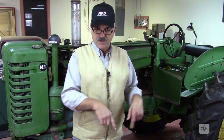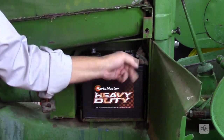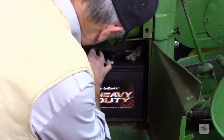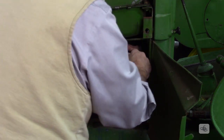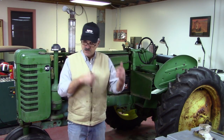Let's get this battery installed. Now, this is a 6-volt system and it's actually a positive ground, so we need to be careful that we don't get those leads crossed. This is the positive cable and this is the ground strap, so we've got that in the right location. This is the power lead, so we'll get that hooked up as well — it's way in the back so sometimes it's a little bit hard to get in there. I don't plan to lock everything in tight. With the battery installed, I'm just hoping I can get the tractor started. It's late in the fall, it's getting cold, we've got snow in the forecast, so I really want to get the tractor put away in its shed so everything is up and running and usable in the spring.